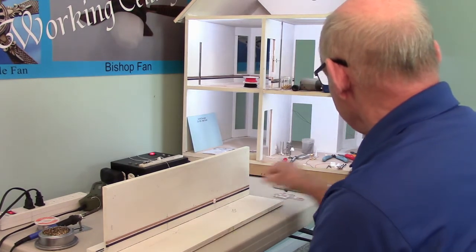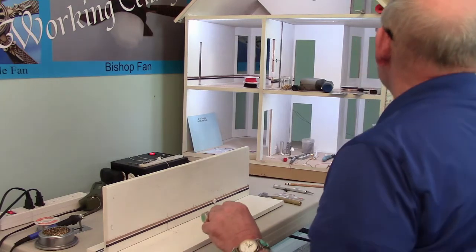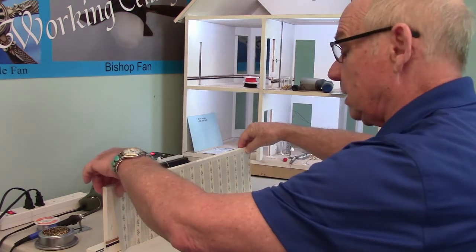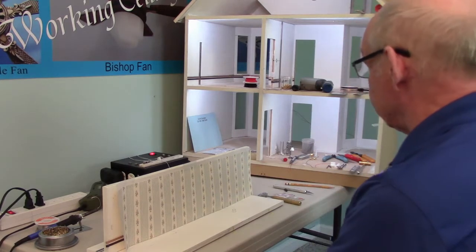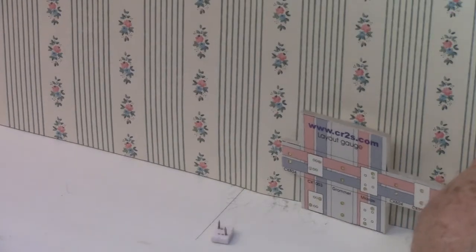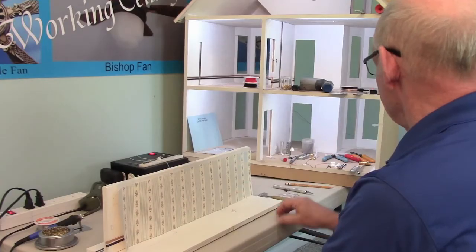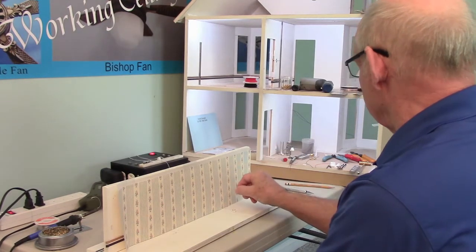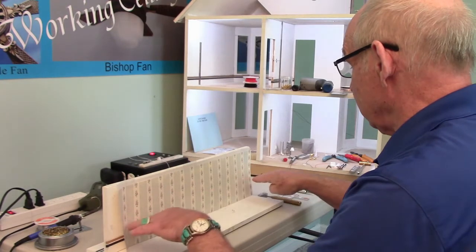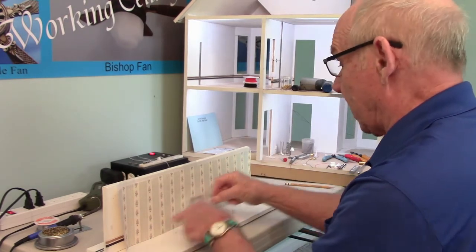There's another way of doing this that is even easier. Most of the time you're going to have the wall wallpapered, so you can't see where the tape run is and you need to try and line it up. Again with the gauge you know exactly where you need to go and can put your pin holes in. Circuit suggests you use very small brads, put them partially into the wall, then when you wallpaper you push the brads through the paper. As long as you have your tape run in the right area, you can always come back with the gauge and put your outlet anywhere you want.